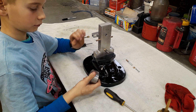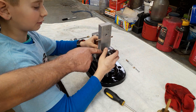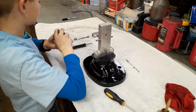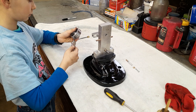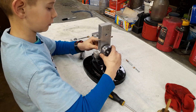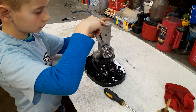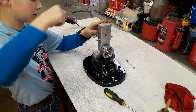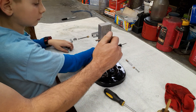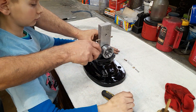That's three-eighths diameter. And then the journal part of it, I think, was one sixty-fourth more than three-eighths. You've got to have a little bit of end shake in it — just like building a clock. That means it's pretty snug.